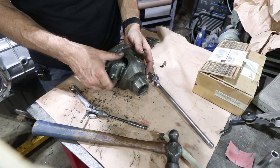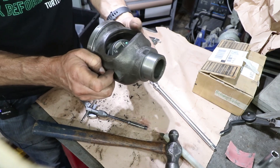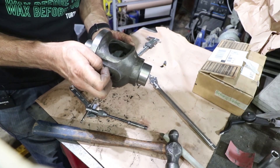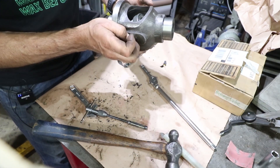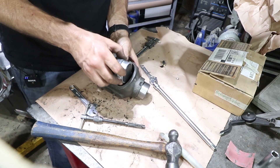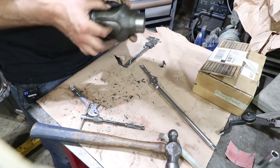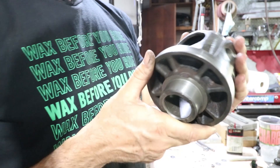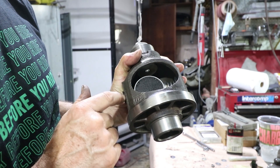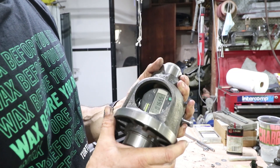The real challenge is going to be to get it to fit inside here — the plunger is just barely interfering. I've got the plunger all the way extended and it's just barely too tight to go in. I've already removed the cap off the back, and I can remove the tip, and I think that'll help. The gauge is now in there secure. I ended up employing a spring that puts pressure on the dial indicator, keeping it snug against the Delrin bushing. It's three-and-a-half digits accurate, and I can switch it between inches and millimeters.